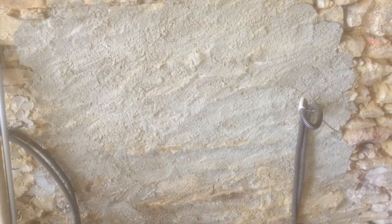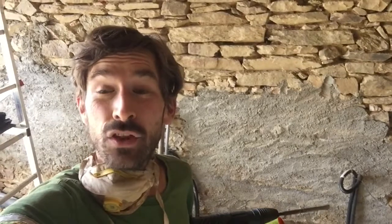This part of the wall was the part I was most worried about. Some plonker has just put concrete all over the wall. But luckily he was such a plonker that he didn't do what I'm doing, which is chasing out and giving a good key for the new layer. So as I'm chiselling the concrete, because there's just sand — or mortar I should say — behind it from the previous filling, it's just falling out relatively easily. So as long as I chase along the grooves of the stone it's hammering it out and it's not too bad.